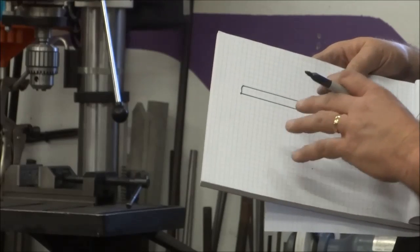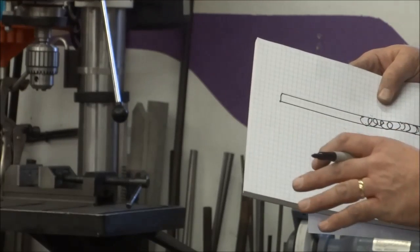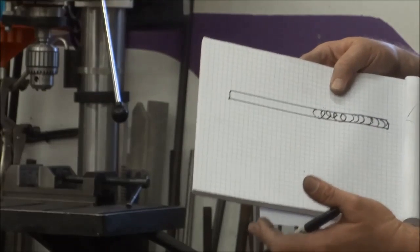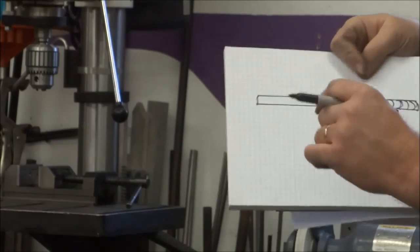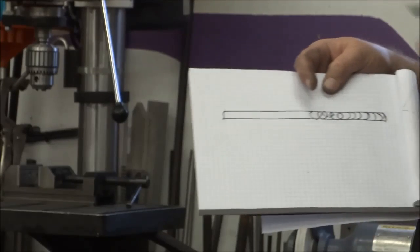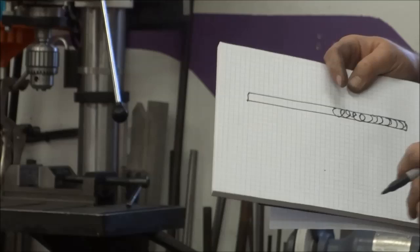One thing I've found on this is you will be running a lower voltage and a lower wire speed than normal. So you can use your gauge, your charts on the side of your welders. Miller makes the little slide rules. Those are okay for starting points, but I've found you usually end up tossing those and I used to keep a little notepad for my welder at work.